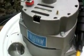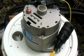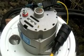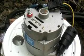The disc is bolted directly to the shaft of this Wind Blue DC 540. This is a permanent magnet alternator, similar in size and shape to a standard car alternator, except it's made with permanent magnets and special windings that give it a higher voltage at a lower RPM. Standard car alternators have to be spinning over a couple thousand RPM before they make any voltage. This one will start producing voltage at around 50 RPM.